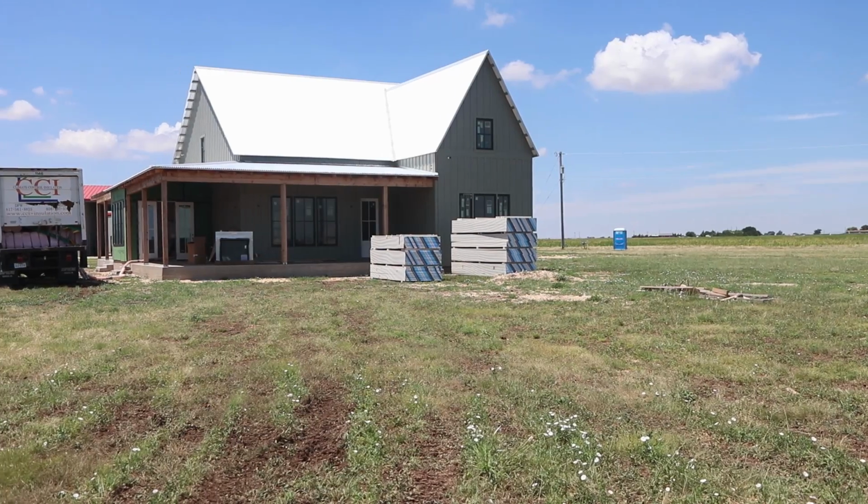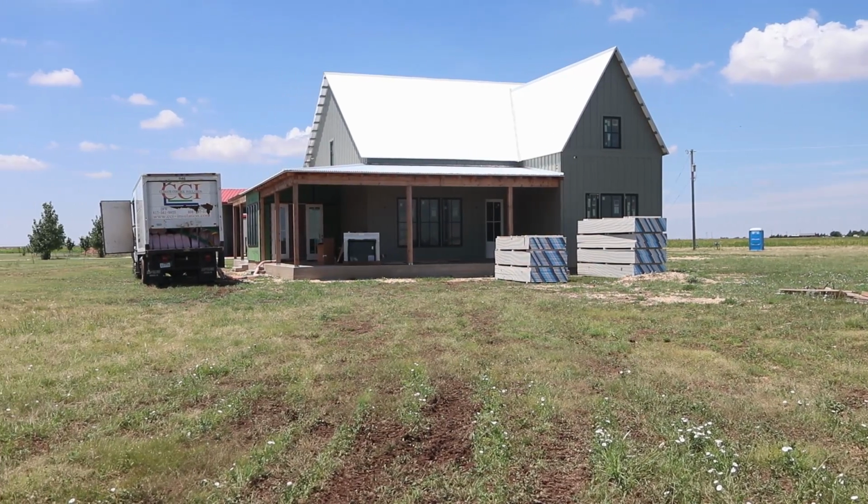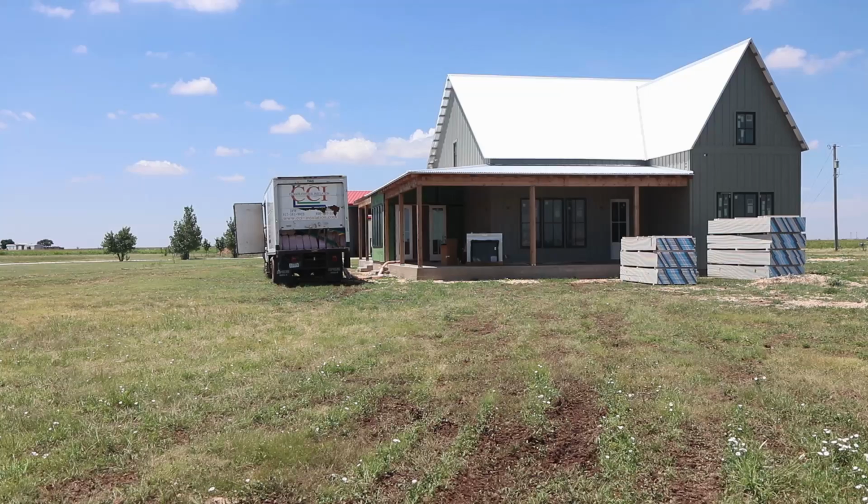So we went from like a 97 square inch hole equivalent for this house down to a 47 square inch hole. So huge reduction. And if you think about it, on a 3,122 square foot house, for all of the holes in this whole house to be the same size as basically a 4.5 inch by 10 inch slot, and that's all the air that we're pushing out of this entire house, that's pretty impressive. And it didn't take long.